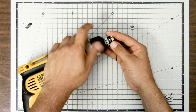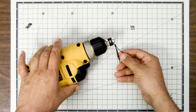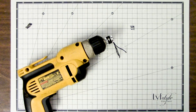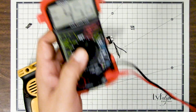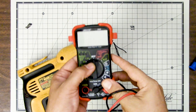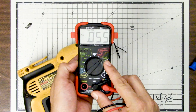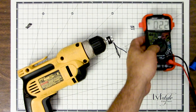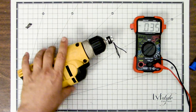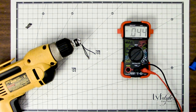Now I'm putting the suspicious motor — chucking it in the drill. You want to be really careful so that the teeth of the chuck don't damage the threads on the motor shaft. Most motor shafts are going to have a smooth part at the very base, and if you fully insert the motor shaft into the chuck, the chuck will close on the smooth part. You don't want to clamp it down such that you damage the threads, or then you really will have damaged the motor.